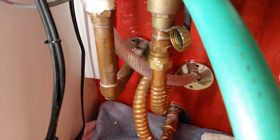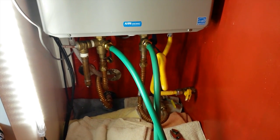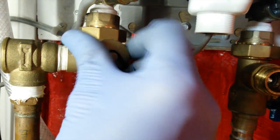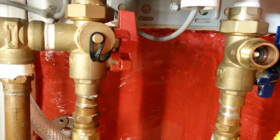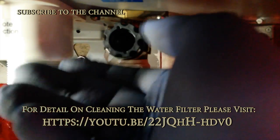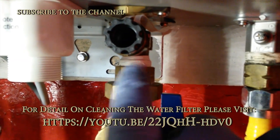According to Rheem, flushing out for five minutes should get all the vinegar out of the system. While the system is flushing out, we're going to disconnect our hoses from the isolation valves, put the caps back on, and dispose of our white vinegar solution. Do not attempt to use this for cooking — it is unsafe. Securing the caps onto the isolation valves. At this point, you should take off the filter and clean it of any sediments and impurities. There's a whole other video on this — check the link below and I'll take you step by step on how to do that.